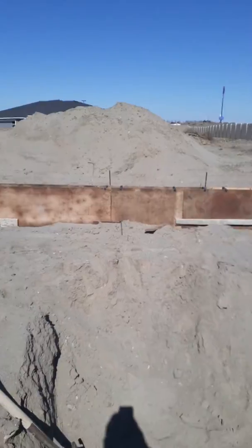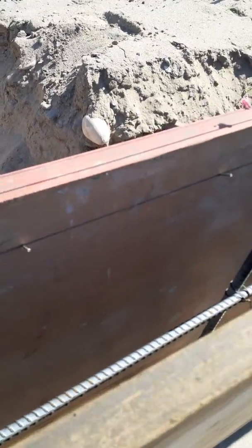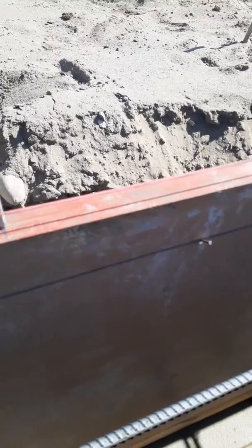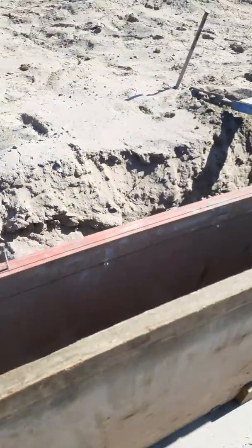It's all dug out and there's dirt piles. One quick thing I really wanted to show: we got a chalk line snapped there. We used a laser level to get our grade in. This line where these nails are is where our finished concrete is going to go — the top of where the concrete is going to go. So it's not actually going to go to the top of our forms here.